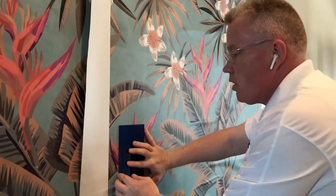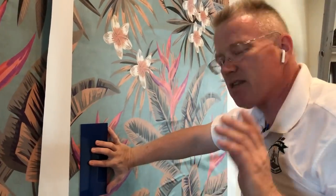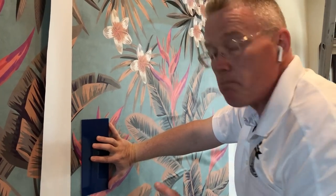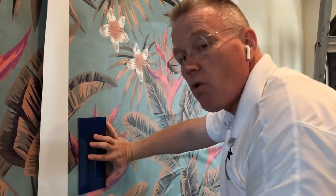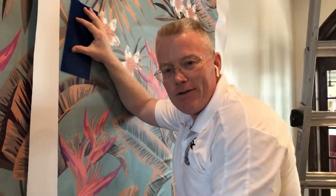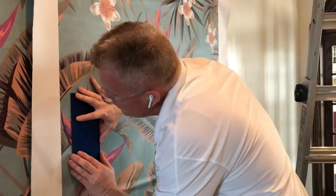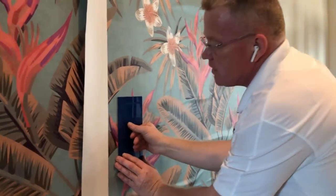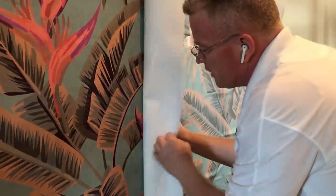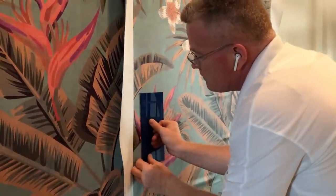This is the overlap. And just in case you don't still understand what's going on here, the manufacturers create a bleed on each edge of the wallpaper. So every piece of wallpaper, every consecutive wallpaper has at the very edge the same pattern on the right underlap and on the left overlap, so that you can cut through the bleed and have a perfect seam, okay? So even if you don't understand what bleed is, this is bleed. It's gonna get cut off, some of this. We just have to make sure that the bleed on top is matching the bleed underneath.